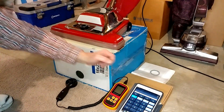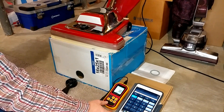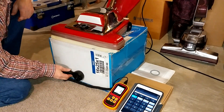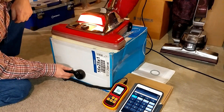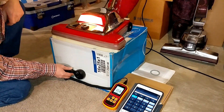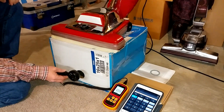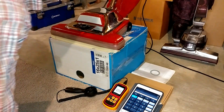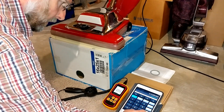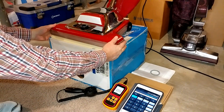We're going to start out. As you can see, the bag is not installed, so we're just looking at the raw CFM going through in a bag shakeout style. And away we go. You can obviously hear the bristles hitting the cardboard. We're at 171 CFM. I'm sure it probably would be a little bit higher than that, but I have the limitations of this airflow box.